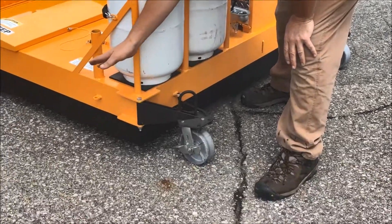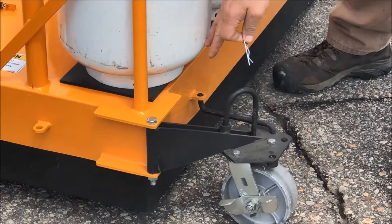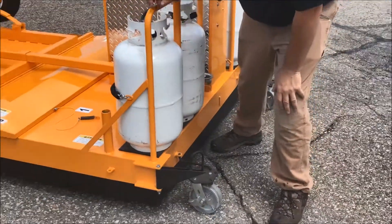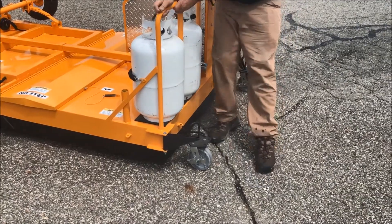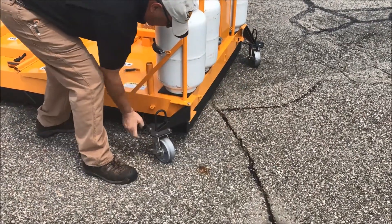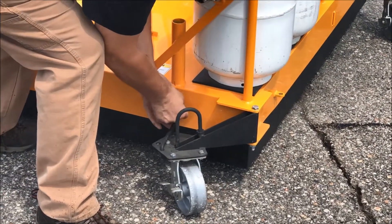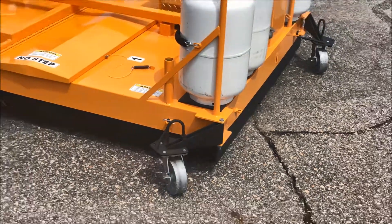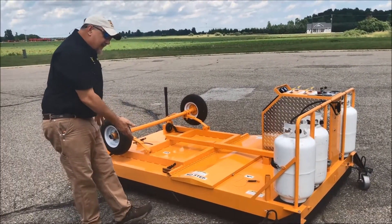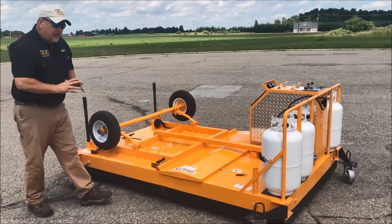To move your caster on this side, if you've been using the unit where it's hot, by all means you need to have leather gloves. This infrared is putting out 1800 degrees of heat — the heat comes around here and it definitely warms up this material. The reason you want to move your caster side to side is that you don't want to roll through what you've just heated up. As this unit is set up on this side, you're going to be moving your infrared forward and backwards, not side to side. You never want to roll through what you've just heated.